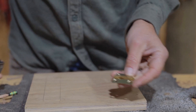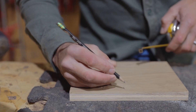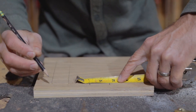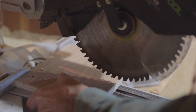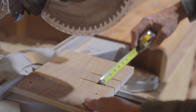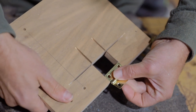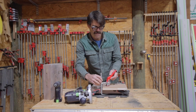I'm going to walk you through another way to mortise out for those hinges. This is typically my preferred way and if you're making multiple boxes I'd recommend doing this. I'm marking out my hinge on a scrap piece of three-quarter inch plywood, then I'm going to use a chop saw and cut it out making a template so I can then use a flush trim bit with a bearing on top. This will make my mortise.